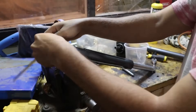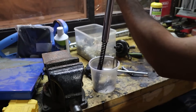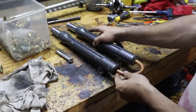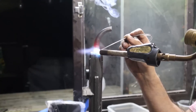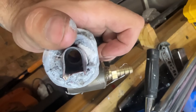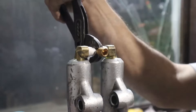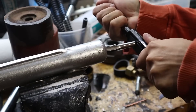I started with the most basic piece, the piston and the expansion chamber. For this, I used two front motorcycle bars. Once disassembled, we see they enter with an almost perfect seal and even generate good compression. In the corner where I had the screw, I had to connect the air or steam inlet. I first tried welding a copper pipe, but the alloy of the bar was horrible and it broke. My second idea was epoxy, but epoxy melts with heat. My third and best option was to make a quarter-inch British standard pipe hole, pass a male through it, and screw a bronze elbow from behind. It turned out spectacular.